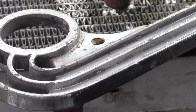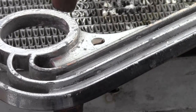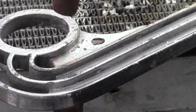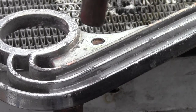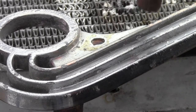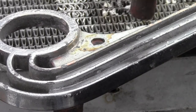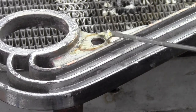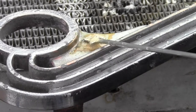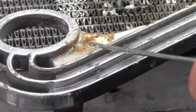Like always, add Super Alloy 1 flux first, then indirect heating — we want our metal to turn the flux brown, not the torch. Always keep your torch moving when bringing the part to temperature. When you see the flux starting to turn brown, I like to add a couple more drops of flux just before I rub or tin the surface with the rod. This will help to build a bridge around and across our hole.